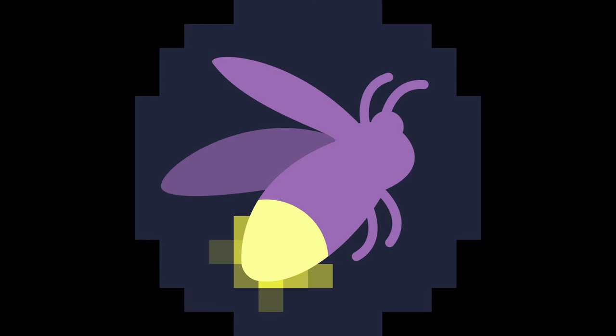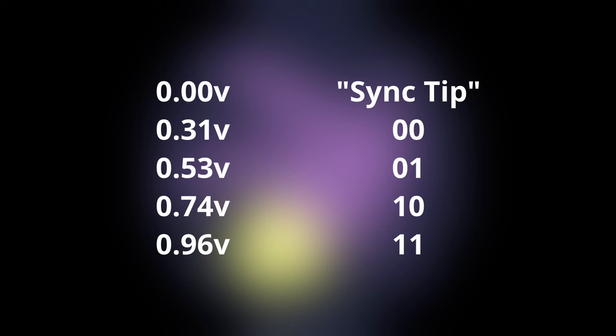LumaCode. LumaCode is a new way of encoding digital video data as an analog signal that can then be processed by an upscaling device such as the RGB to HDMI — with proper hardware and programming to interpret such data and reproduce the image exactly as the source computer intended it. What will really surprise you is that this encoded data requires only a single signal-ground pair to transmit its information. Copper Dragon has designed small interposer boards he calls digitizers, or Dizers, that sit between the chip producing the digital video signal and the motherboard of the computer in question. This board uses a specially programmed FPGA IC, or Field Programmable Gate Array, to intercept these digital video signals and output an analog voltage level for communication with the upscaler.